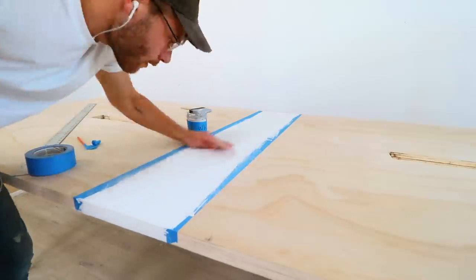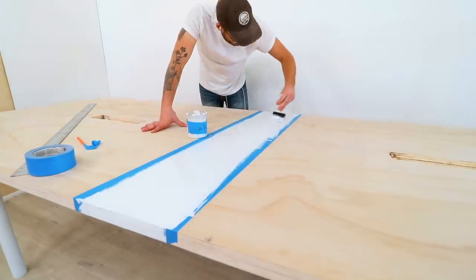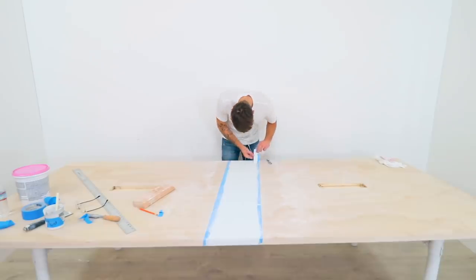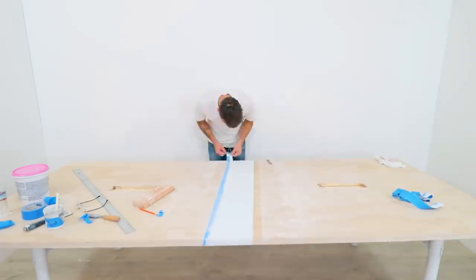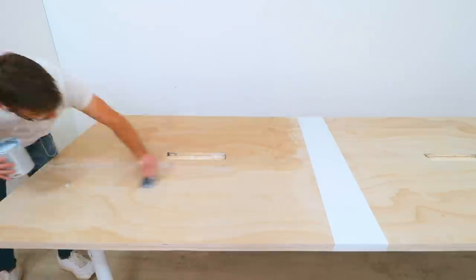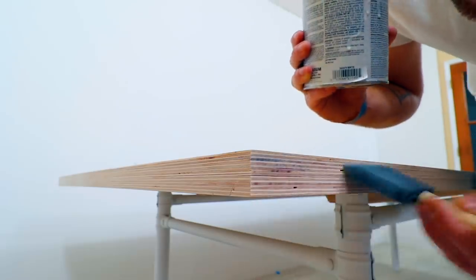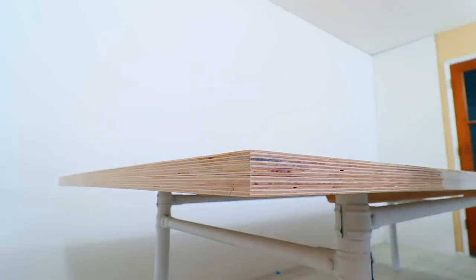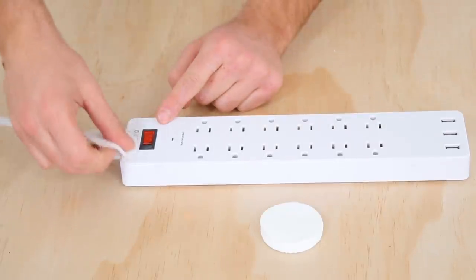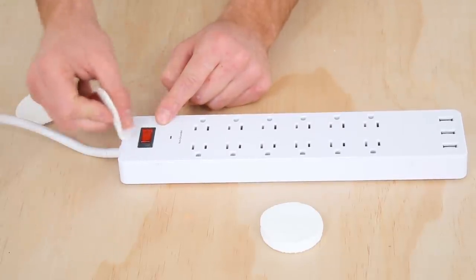When laying out my painters tape I didn't want a straight line down the table — I was worried it would look too much like a ping pong table. So I used the center seam as reference, measuring six inches from the seam on one side and an inch and a half on the other, then did the inverse on the opposite side to create a cantilevered slant. Because of the paint, I used three coats of water-based polyurethane to keep the paint color true. Fun fact: if you want to get rid of printed logos on products, a little acetone on makeup remover pads works great — just be gentle so you don't remove the base color.